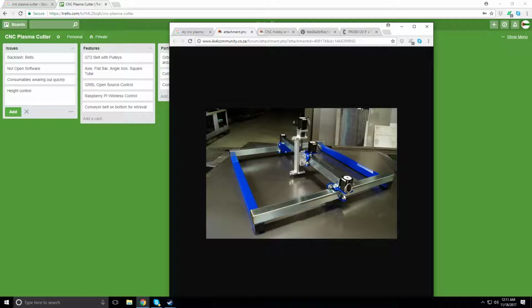So how TechShop did it is, obviously everything on TechShop's one was aluminum extrusion, box aluminum extrusion. And I think it was maybe 2 inches wide, maybe 3 by 3 inches wide, and then they have the slot where you could put T-nuts in there, and then they had a plate go down the bottom, and then they had the slats, they had the ribs go in there. So that is another way of doing it.